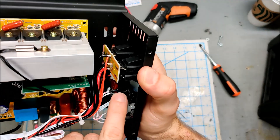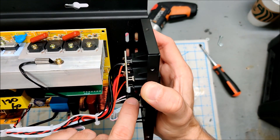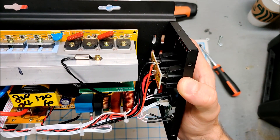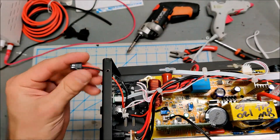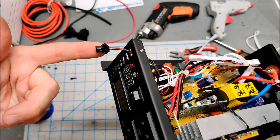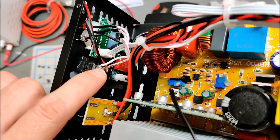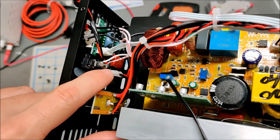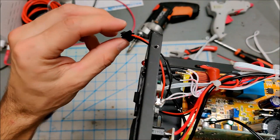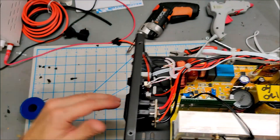There's the switch and you can see it's got just these puny little cables on it. If we just bridge onto this switch with our own switch, we'll be able to externally turn on and off the inverter. I've bridged on the external connection and ran it out the front vent, using a connector so I can plug in my wiring from the solar generator and still unplug and remove the inverter if needed. The internal wire and my wire are both soldered onto the two pins of the switch. Now we are able to externally turn on this inverter.